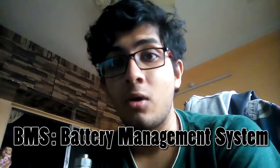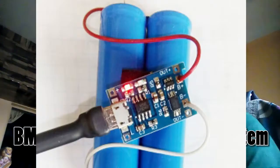So getting these protective circuits online is kind of important. You can buy a BMS or those TP4056 modules which offer you a protection IC plus a charging IC, which is cool. But I don't have one — I ordered it but it hasn't come yet. So I figured out a way to charge your lithium-ion batteries without a proper charger.